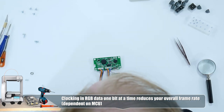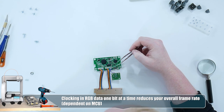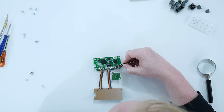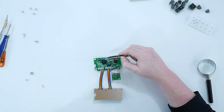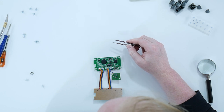One thing that I noticed right away with this, there's two main ASICs here. Then, well, this is a power regulator. Yeah, it has to be, because the power comes in here. You got your switch here. You've got a big cap here. Also, that looks like a power regulator. The thing that I find interesting is you have these two SOIC8 chips, and I'm wondering what those do.